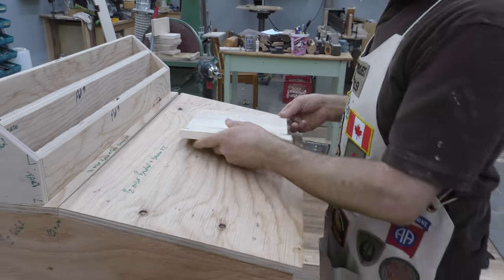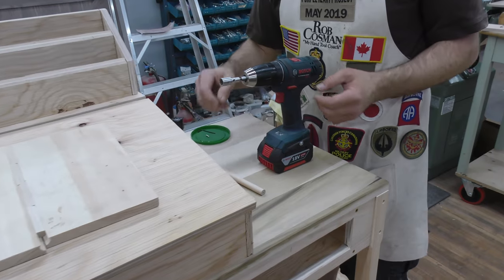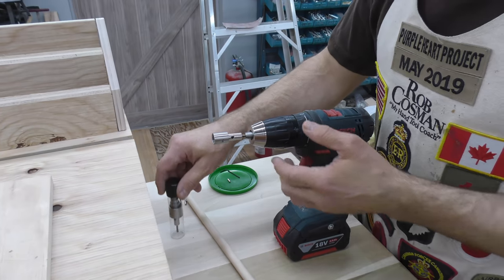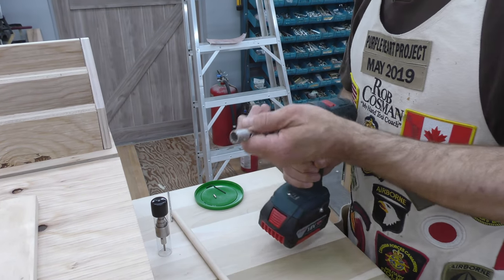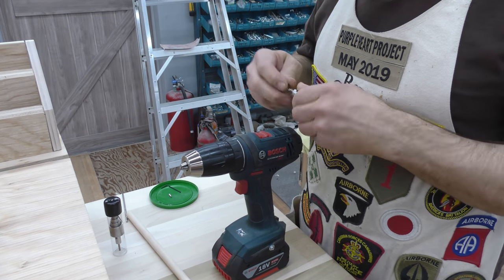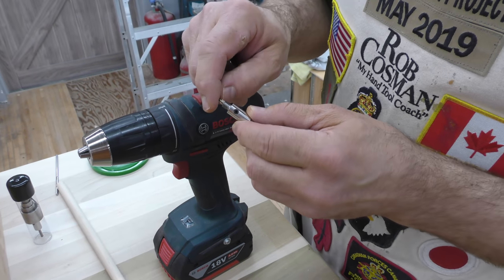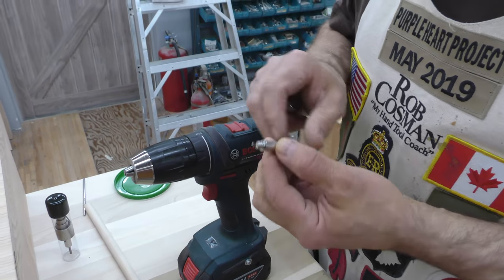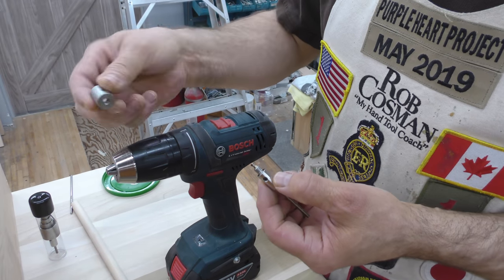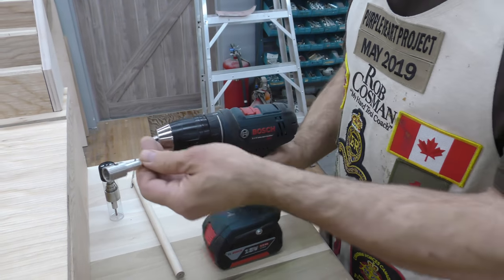And we have a little kit that we make wooden hinges with. And it's as simple as that, several pieces in there, because that allows you to do four different sizes. So you can have 1/4 inch, 3/8, half, or 3/4. So there's two different bit holders. One holds a 1/8 inch bit, the other one holds a 1/16 inch bit. This is the 1/8. You put the bit in there and then lock it in place with the set screws. Choose whichever size dowel you're using, in this case, 1/2 inch. Screw that on. Mount this in a drill.